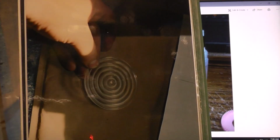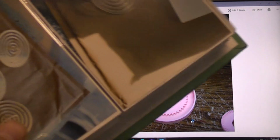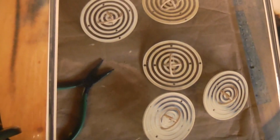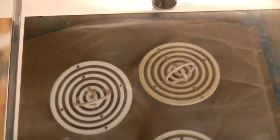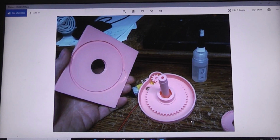here's a picture taken back in the late 1980s, early 1990s. This is the machined disc. The gyros themselves are formed from those machined discs with grooves in it, and then the grooves are painted white, and you can see there's little holes, and if you look real close you can see there's little wire hoops being placed in all those holes. And that's how it is done if you're trying to build the gyros screen accurate.